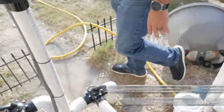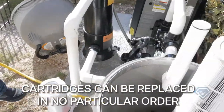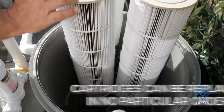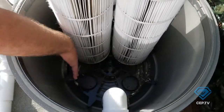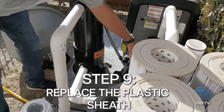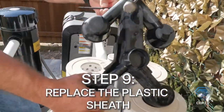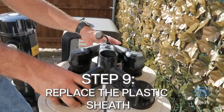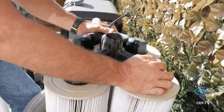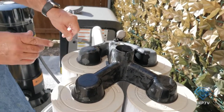If they're clean, usually you can seal them hand-tight — give her a good turn and she's done. Next, the base is in, so we want to stack our cartridges. There is no specific spot — all four of them go in there in no particular order, just want them all standing up on your nice clean base. You'll have to slide them around to make them fit right. Now take the top piece and make sure this tube goes into the pipe, sit it on there, and give it a little wiggle until everything feels nice and snug.